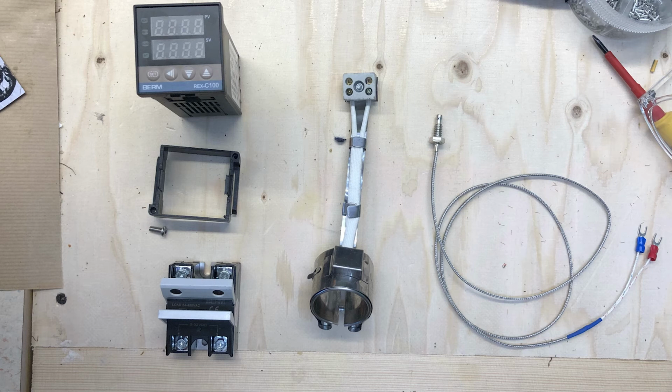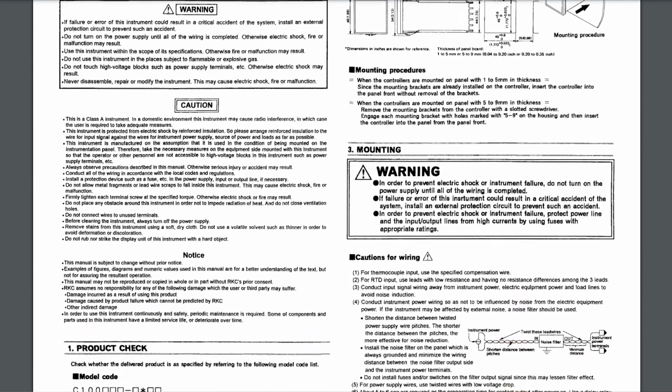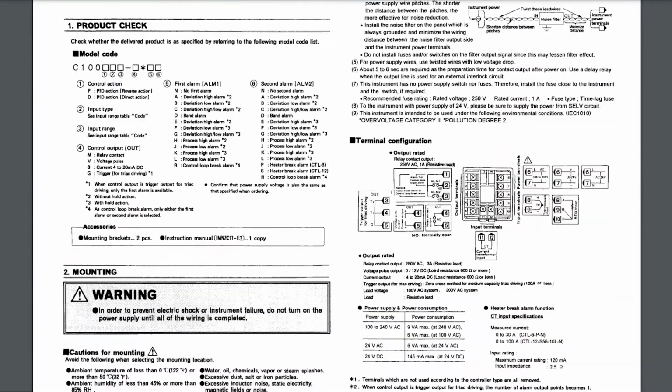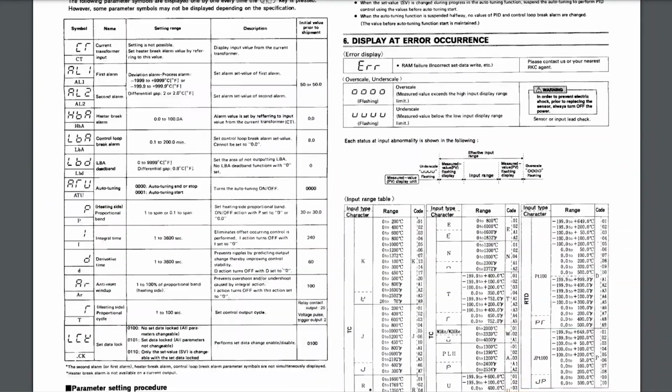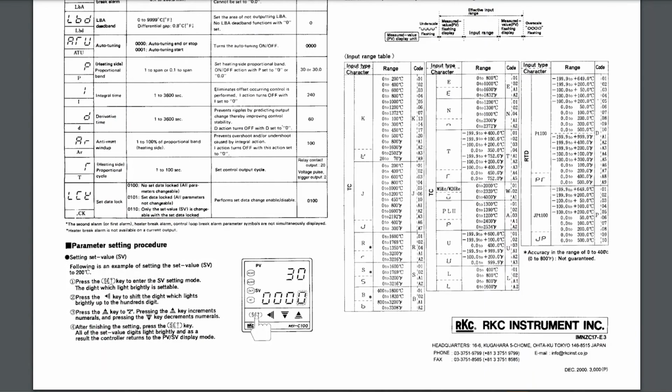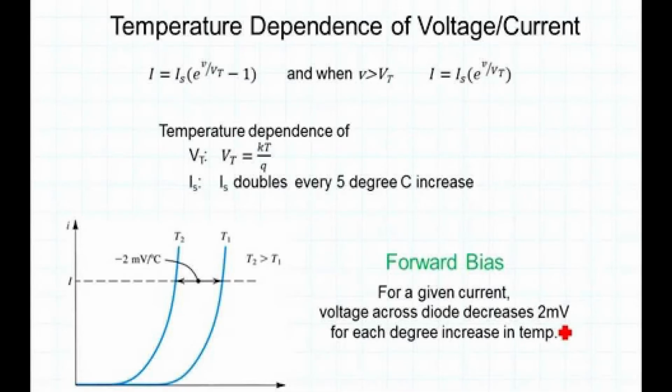He advised me about the problems with some of the electronic components I'd purchased for the project. The main being that the band heater and SSR controller had incomplete datasheets. This meant that the current rating for the band heater was unknown, meaning it was also unknown how much current would be passing into the SSR controller. This was a problem as the resistance value for the SSR was also missing, so there would be an unknown degree per watt rise in temperature when it was switched on.